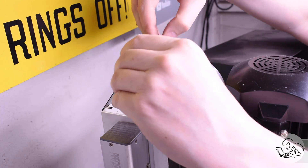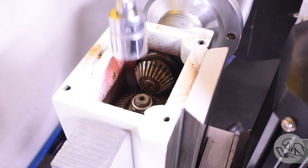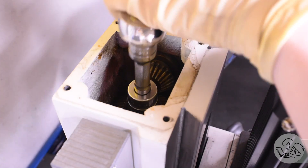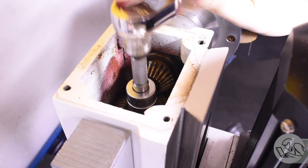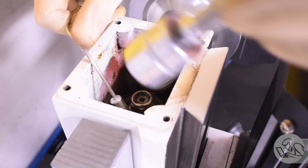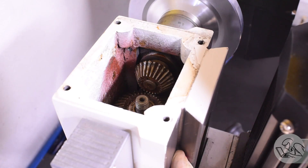This is a very straightforward mechanism — just two bevel gears, one on the crank and one on the column lead screw. There's some mystery grease on there that I'll freshen up while we're in here. Next step is to remove the nylock nut on the lower bevel gear. You hold the hand wheel to keep it from turning and then just loosen that — it's not very tight because it really doesn't need to be. My biggest concern is dropping that nut down the bottom of the column because I have no idea how I'd ever get it out. I've got a magnet there, but it turns out the nut is stainless anyway and the magnet was just decorative. At least I didn't drop it.